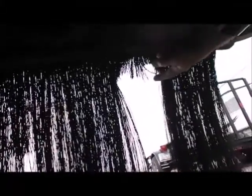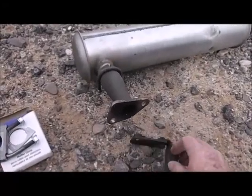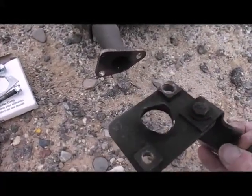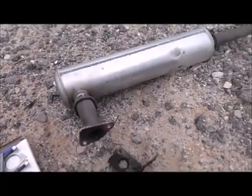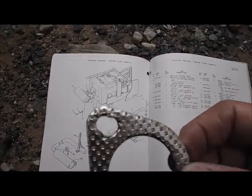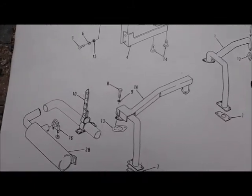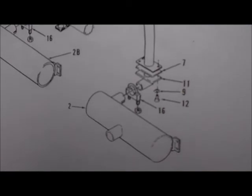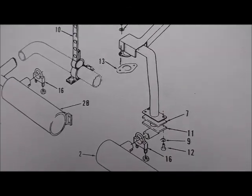There's a hole right here because this is where the exhaust pipe went for the generator. This is what was on the bottom of the exhaust pipe — it was welded right there and the weld broke, must have rusted through. I actually thought it was the gasket. I ordered a gasket and went to put it on, and realized the flange weld had broken. That flange broke off.